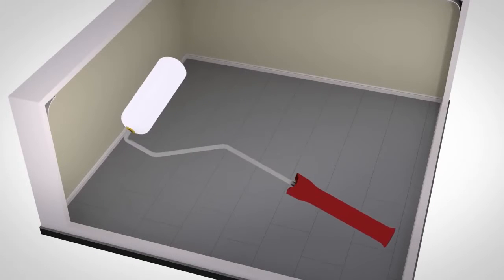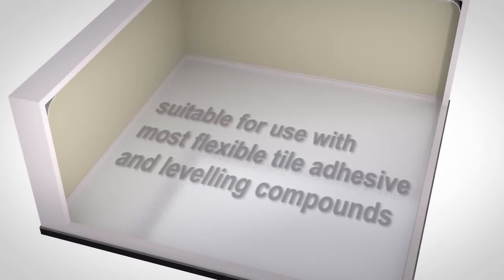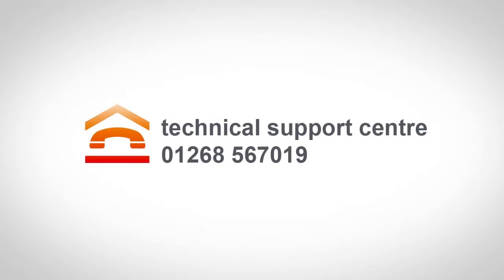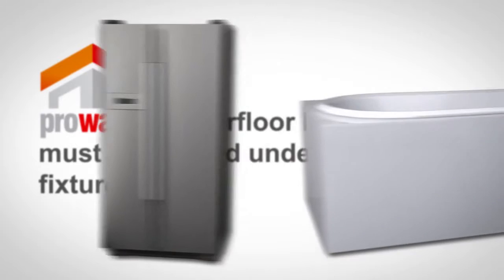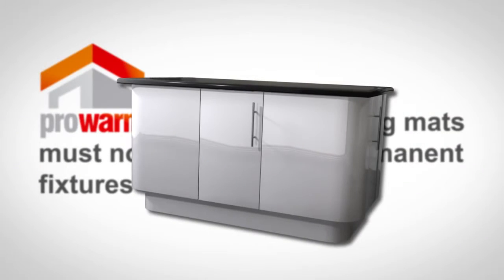Proceed to prime the backer boards with a suitable primer. Prowarm's revolutionary fast heat thermal primer is suitable for use with most flexible tile adhesives and levelling compound. Please call our Technical Advice Centre if you are in any doubt. Prowarm Underfloor heating mats must not be laid under permanent fixtures, including electrical appliances, baths and toilets, cabinets and other types of fixed units.